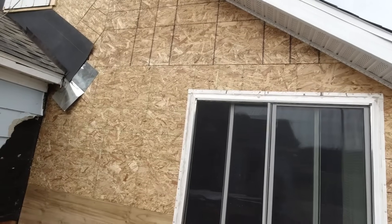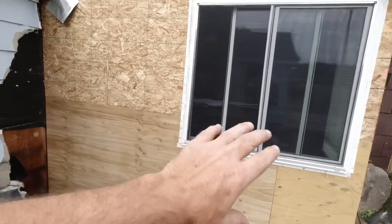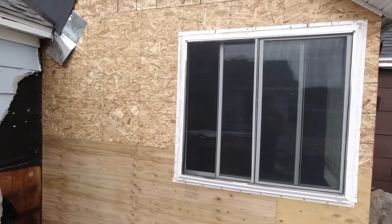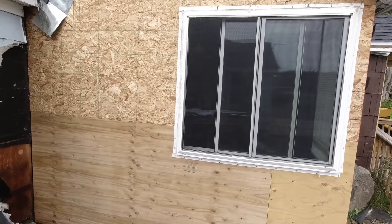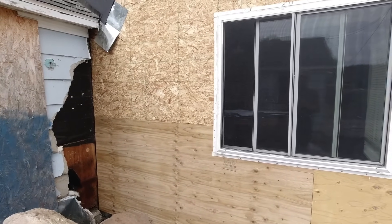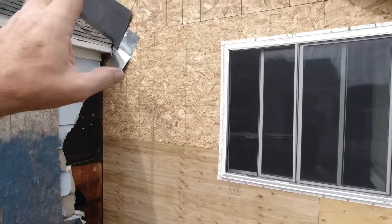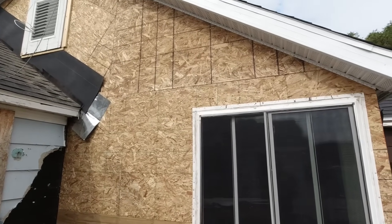This is also going to have rain and ice protection over the seams down at the bottom. First I've got to get the rubber flashing that sticks on and molds around the window to seal it real good. This will save this house — I rebuilt all the two-by-fours inside and put all new wood on the outside with plywood. Down at the bottom it'll be tar paper, then metal screwed in to seal it, and up top Tyvek coating to help with wind and protect the OSB.